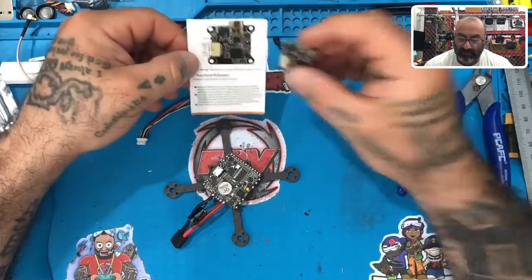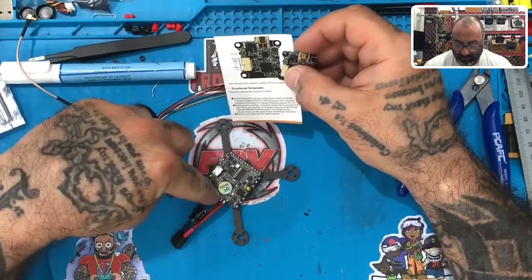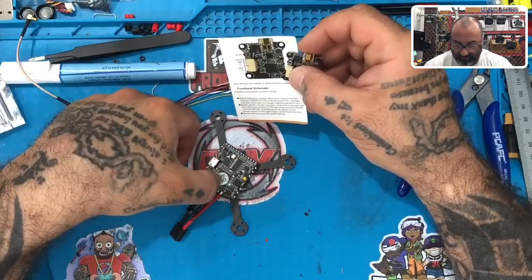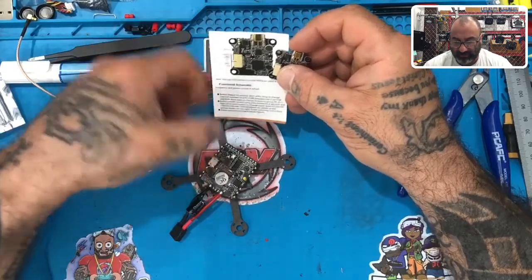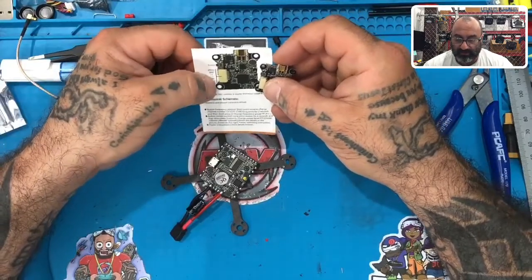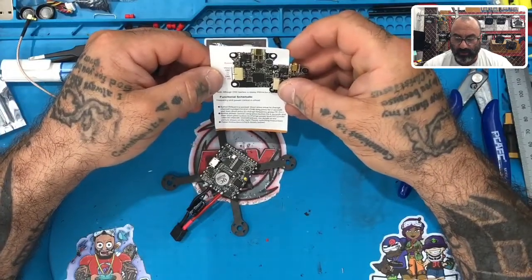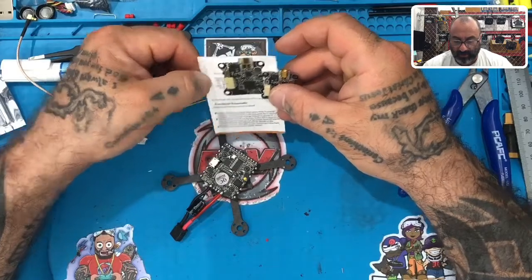So 7 to 26 volts is your input power. We're going to take that and put it right to our LiPo — the plus right next to where we put the XT30. We'll use the plus, the VTX in the middle, and the ground. Then we're going to take the RX and go to TX3 on the top of the board.